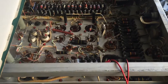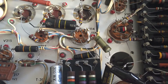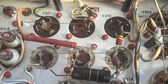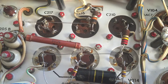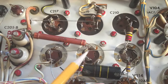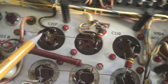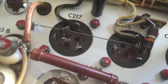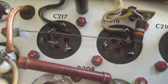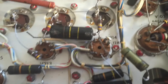Hey, so I wanted to talk a little bit more about my adventures on this Tektronix 514 that I've been trying to overhaul. I've gone ahead and tested a bunch of these caps for value and leakage. These three cans right here were actually successfully reformed, which I have covered in another video. These two here were actually re-stuffed and I will show that in more detail later — there's a new capacitor inside the body of an old capacitor.